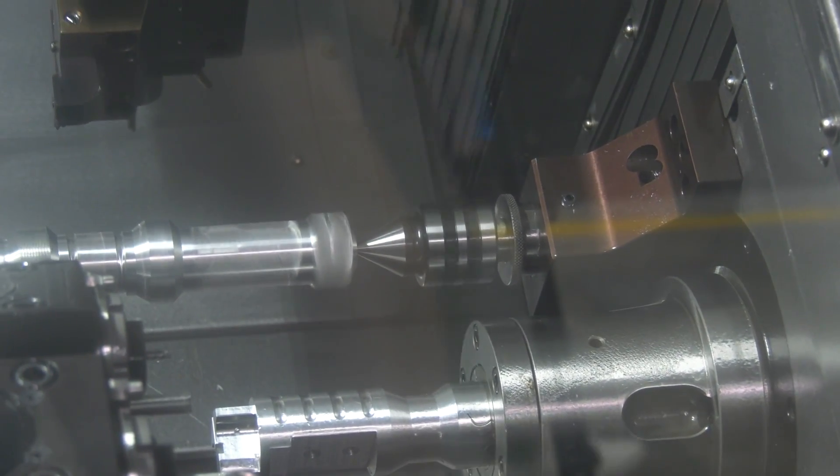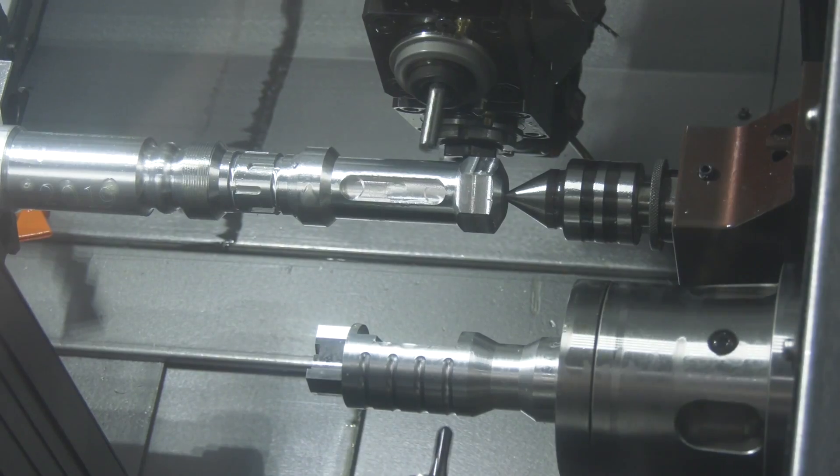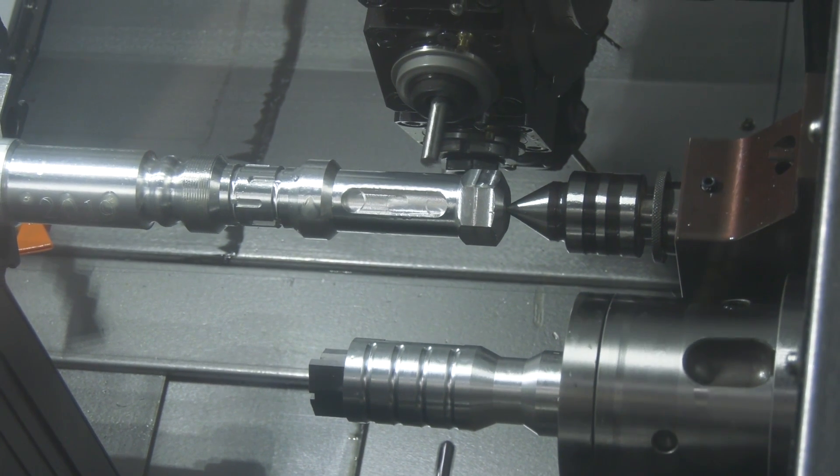Just explain to me about this tail stock here, because that's sitting just above the second spindle — that's purely to support spindle one? Yeah, for op one. Actually that was really derived from the business they've done locally with one of the biggest ball screw manufacturers. They actually prepare the ends of the ball screw on this machine, and they literally sold over 150 machines.